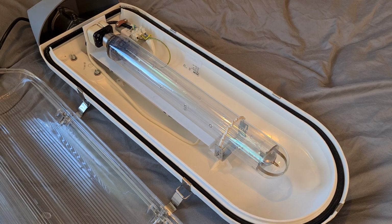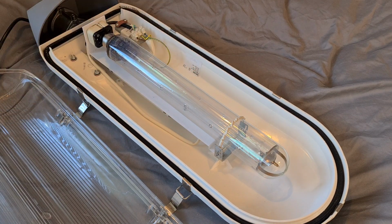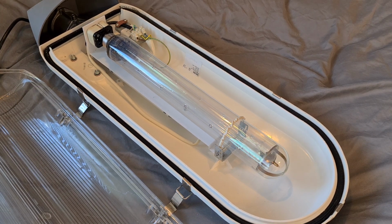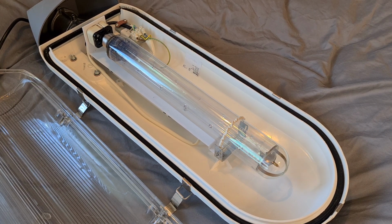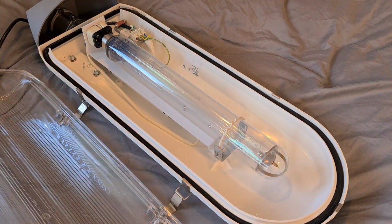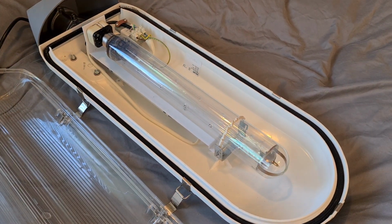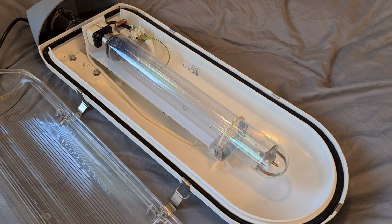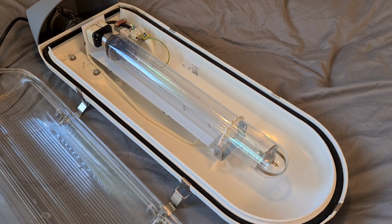For the PLL, it's a bit more interesting. You can get 36 watt and 55 in here, and maybe 80 as well, but I've never seen that. The middle-sized version has most of the time 2 times 36 watt, one bulb there and one bulb there. I don't know if the biggest version exists in PLL. I don't think so. Let's go back to the unit of this fixture.